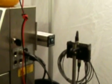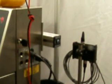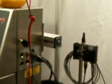While the drops are being set, everything has now just come back on with the printer. I'm going to go back to the conveyor stop module and press the reset button. And you can hear the buzzing again from the meter, indicating that our contacts are now closed. The green light is back on the alert light, and the conveyor would be running again at this point.